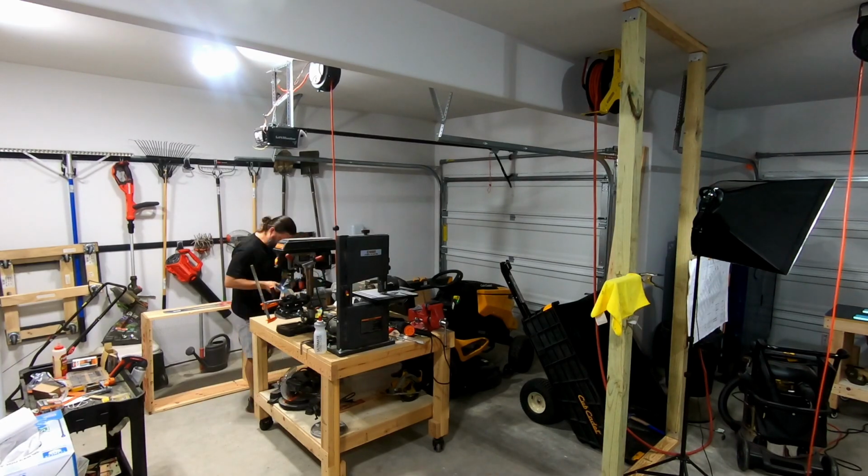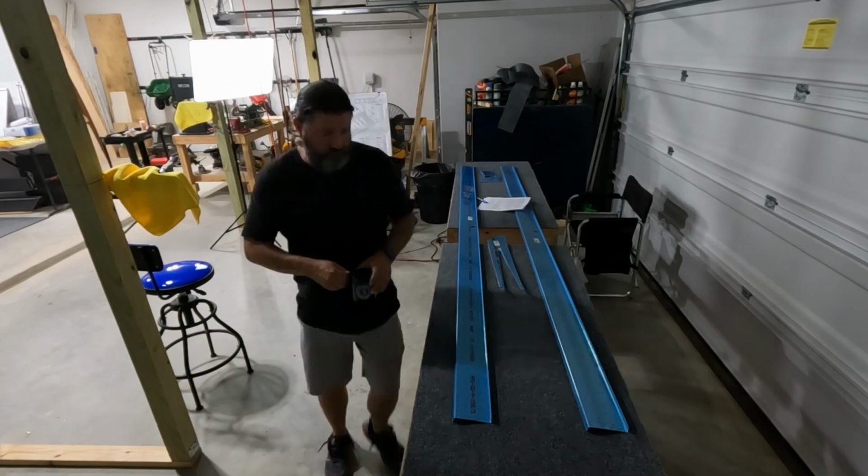Pretty standard parts prep. These spars have a reinforcement fork on the inboard portion that you see me working on there. This is very similar to what you find on the vertical stabilizer. And then on top of that is a doubler on the most inboard portion of it. So it's a really thick piece of material once they're all sandwiched together.